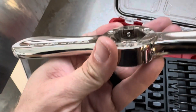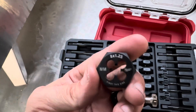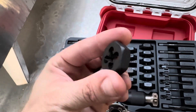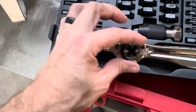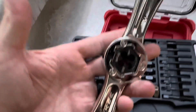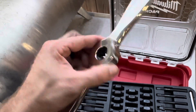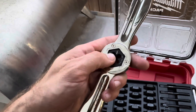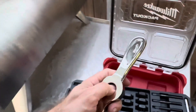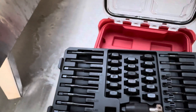We got some ball bearing detents in there. We'll grab an M8 1.25 — you can see they are very well marked. So you would just go like that. Put it on a bolt and chase the threads, and you can see that pops in there. Normally you have like a little set screw on most of these and that's kind of a pain in the butt — it has a little angled piece and it doesn't really fit all that well. But look, that's in there, that's solid. We can chase that down on a thread super easy and put it right back.